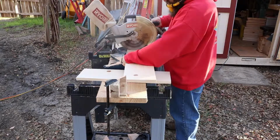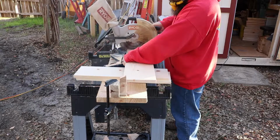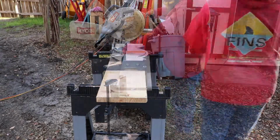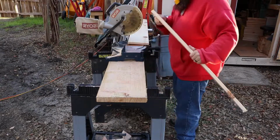I also picked up a single 1x10 board for a couple of deeper shelves. I took my time digging through for boards which were relatively straight and straight-grained, and chose boards with a few big knots over lots of small knots to add a little character.